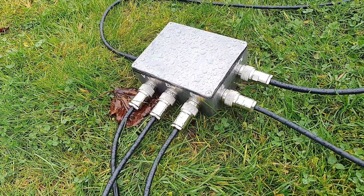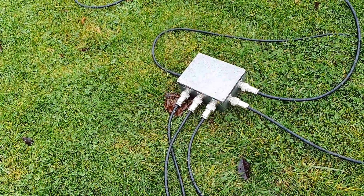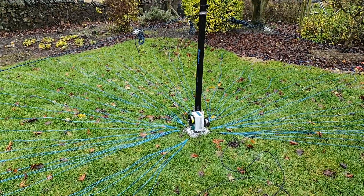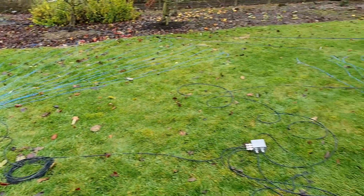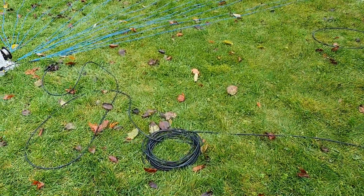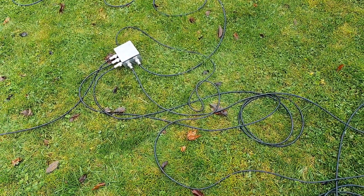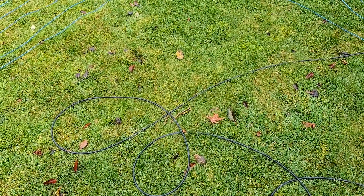D2 is the direction that the gain is going in when the relay is not engaged — that's how I remember it. Currently we have this set up almost north-east/south-west, which is probably not ideal for the time of day, but I'll probably come back here at night and see if we can work some stateside. The phasing lines are 157-degree phasing lines — two of them — and the delay line is very short at 39 degrees. Then there's the coax going back to the rig.